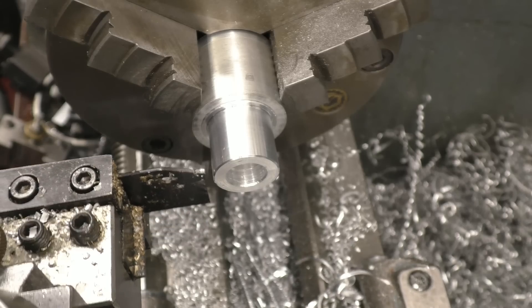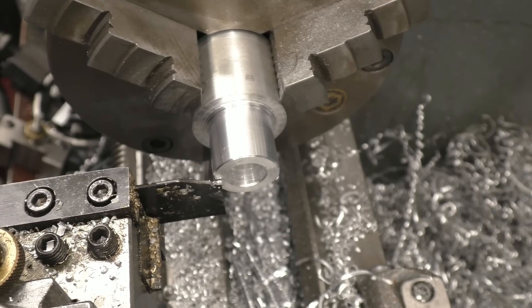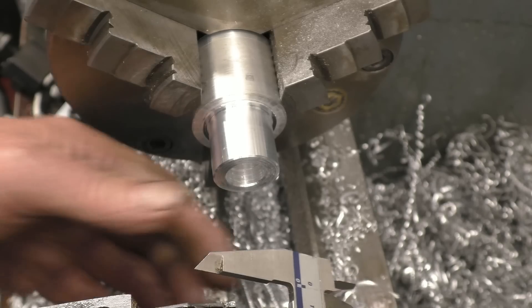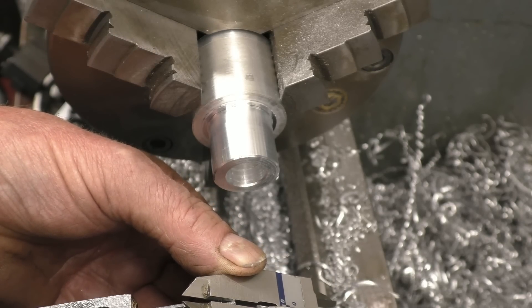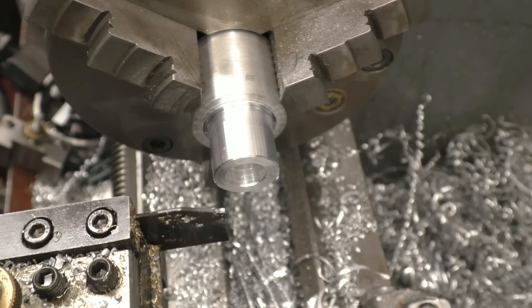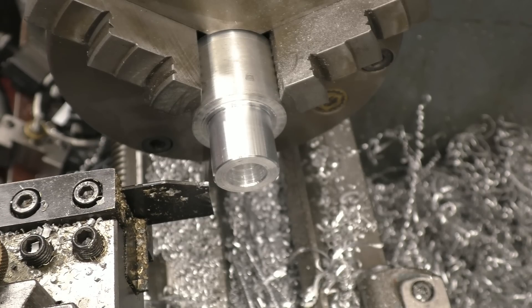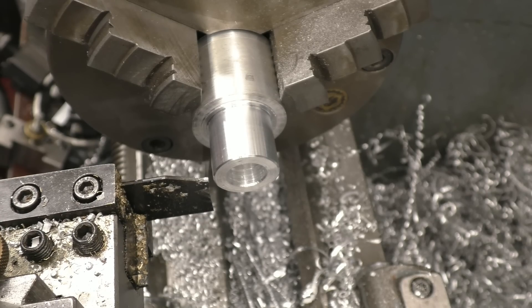I think we want 18.7. Try that — tips 2 mil. I'm going to touch that off gently on that face. Zero the DRO — 2 mil. Right, that puts us right on the end. Zero that again and then we wanted 17.65 — I'll do 18. I'm going to turn it down and face it.